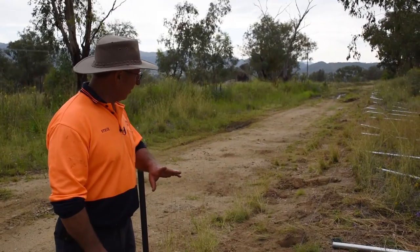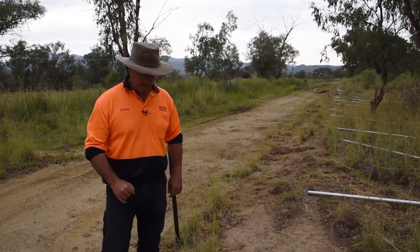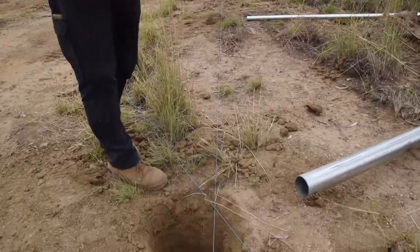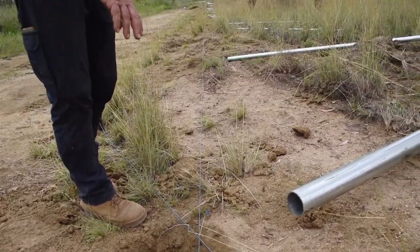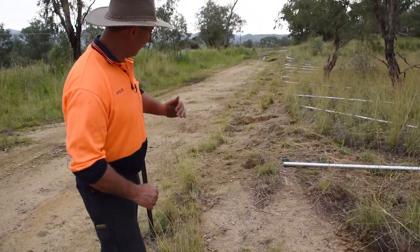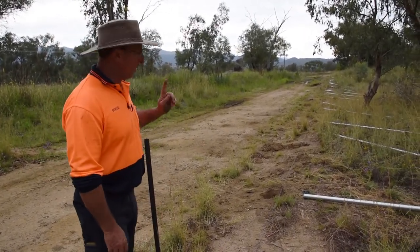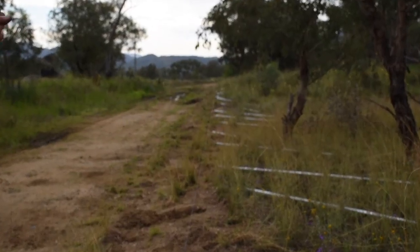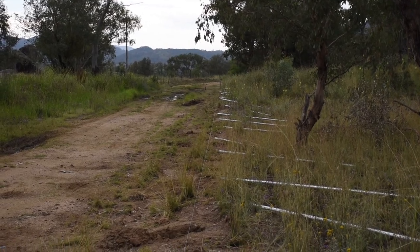Here's the spot that we're going to concrete shortly. We've got all the posts lined out, holes are dug, our sight wire is set, and we're just waiting for the concrete truck. You can see the corner here where the lines cross over — that's where the corner post will sit snug against those lines, and then we'll offset all our line posts off the wire as we normally do in a fence line. We're going to grab another couple of star posts, put them in, and tie that line wire so it doesn't move when we put concrete in the holes.